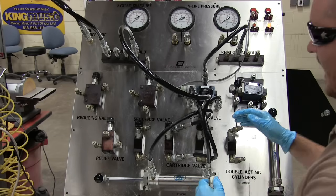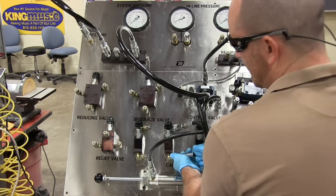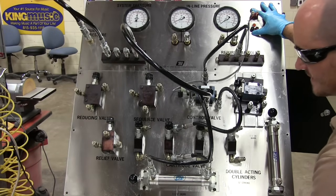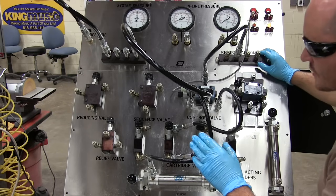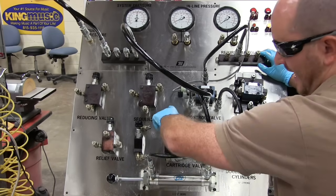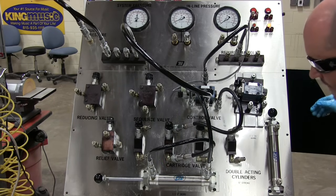If I come into this circuit and switch the hoses on the flow control valve itself — this is what makes meter in and meter out so confusing — it uses the exact same flow control valve. Now I turn it on: it goes back just as fast as ever, but it's going slow on extension. So I'm extending and restricting the flow on the output side. When extending, this is my input and this is my output — and my output is attached to the flow control valve — so this is running meter out on extension.